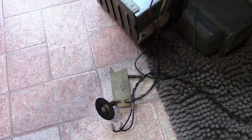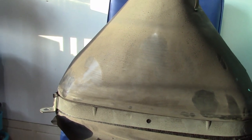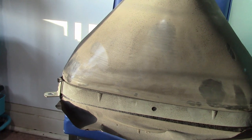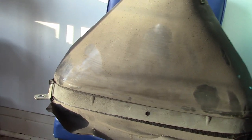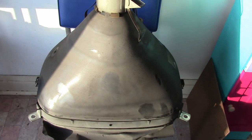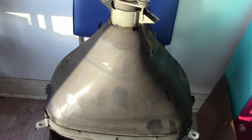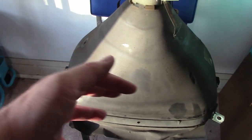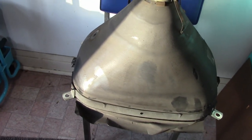Something called dielectric absorption — there's sort of a memory in the glass and the capacitor it forms, and the charge will return. It won't be as strong, but it'll be enough to give you a little bit of a bite. So if you're going to use the screwdriver method, do it two or three times and pause a little bit in between each time, maybe 15–20 seconds, until you are thoroughly assured that there's nothing left. Even if there is a charge, the concern is not that it would electrocute you or stop your heart — there's not enough current to do that. But there is enough current to give you a shock, which might cause you to let go and drop it, or your hand to pull away and smack into something else, and that's how you get hurt. So make sure it is discharged before you come anywhere near that.